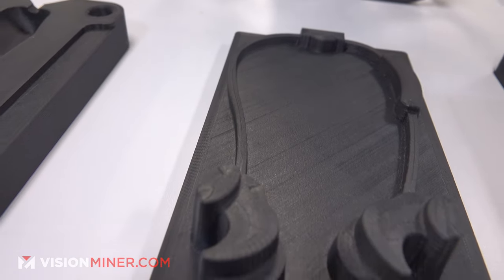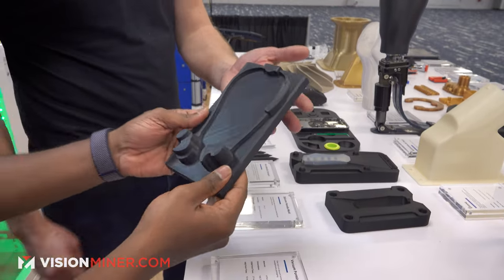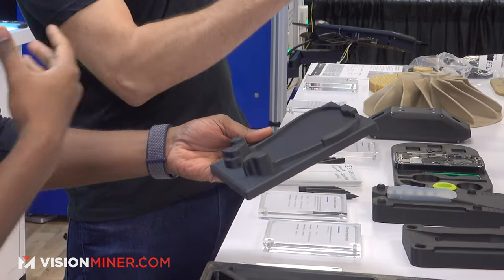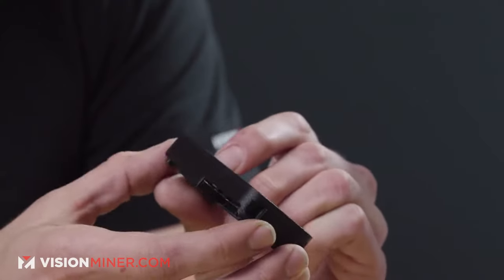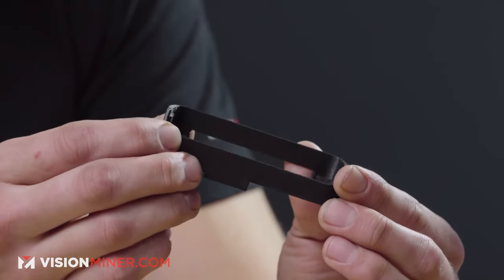This part here is your HTN-CF25, right? What's this for? This one is particularly made for vacuum forming of earbuds. When you buy earbuds, they come in a tiny white sheet — this is the case that hangs on the shelf. You need a high-temperature material with high stiffness. HTN-CF is perfect for it. It can withstand temperatures up to 200 degrees centigrade, and it's one of the stiffest materials out there because it has 25% carbon fiber — highest in the market. They call it black aluminum because it can replace aluminum in many applications.